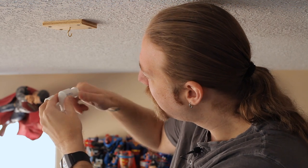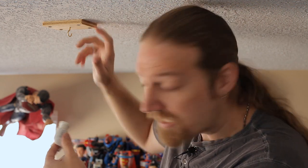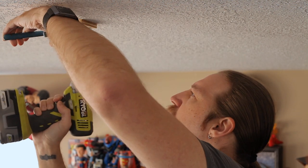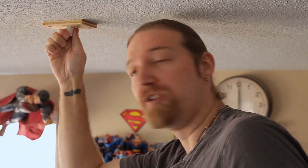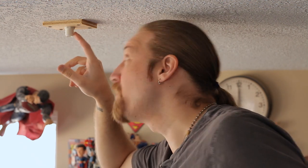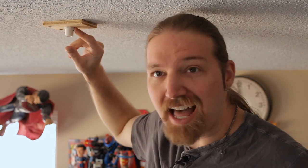So I could use a plug and make my 90L like that, which might be okay, but since I already have this wood block here, I might as well just screw the plug on there, which would be very minimalistic and very simple. Now it is on there pretty securely, but just to make sure that it doesn't come loose — since I am going to be screwing on and off this probably pretty frequently — I'm going to drill a small hole through the side. Basically fire in a locking screw, so this will prevent that from ever being able to turn.